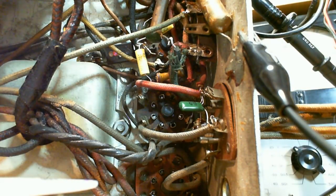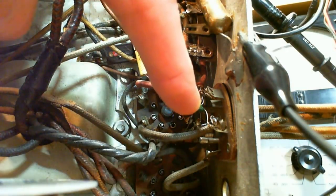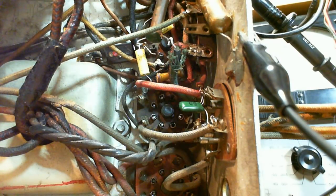Okay, so this capacitor is the one that's across the primary winding of the output transformer, even though the transformer is up on the speaker. This is the leads that go to it. That's interesting. That capacitor marks the two particular leads that go to the primary side of the output transformer. That's an interesting little rule. A capacitor like this I find in almost all radios. Exactly why it's there, I think I said before, I don't fully know. I can take guesses, but I don't really know. Too much guessing and imagination in this world these days, so I won't share mine on that.